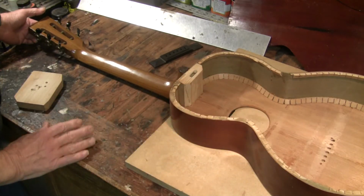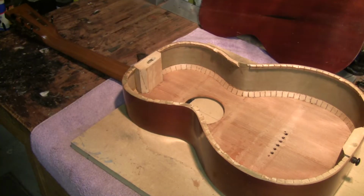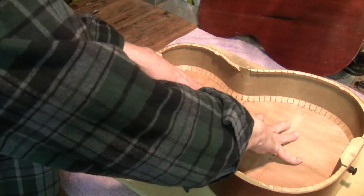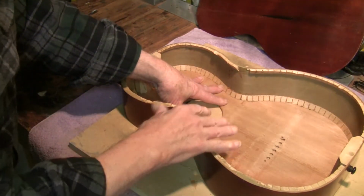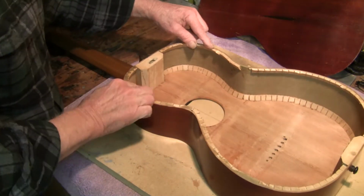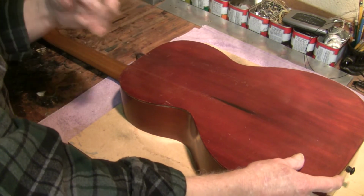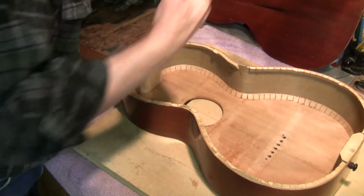This is a continuous surface, and in the world of CAD and engineering, it's topology. So, this board being flat, and having the relief here and here if you need it, lets you press the top flat if you need to. You can restrain this as much as you need to and start to manipulate this. Keep in mind that when you raise this, these go out and these go in. It's topology. If this fit exactly before, it won't fit exactly after this happens. You'll have to provide for that. Add binding, paint it black.